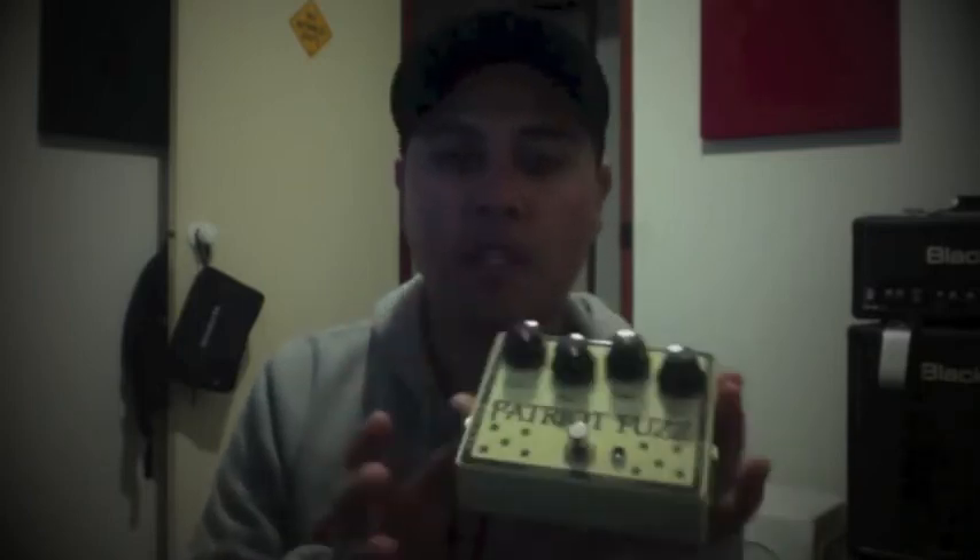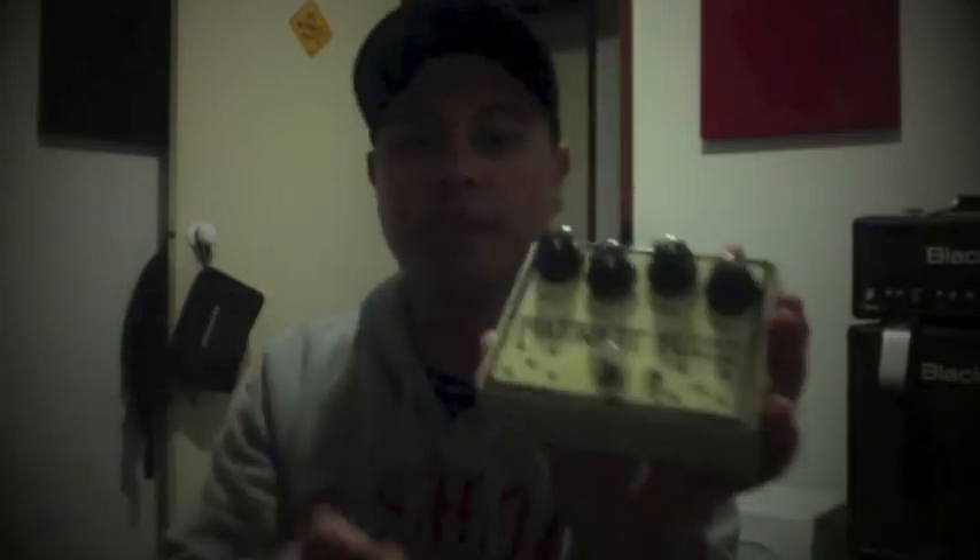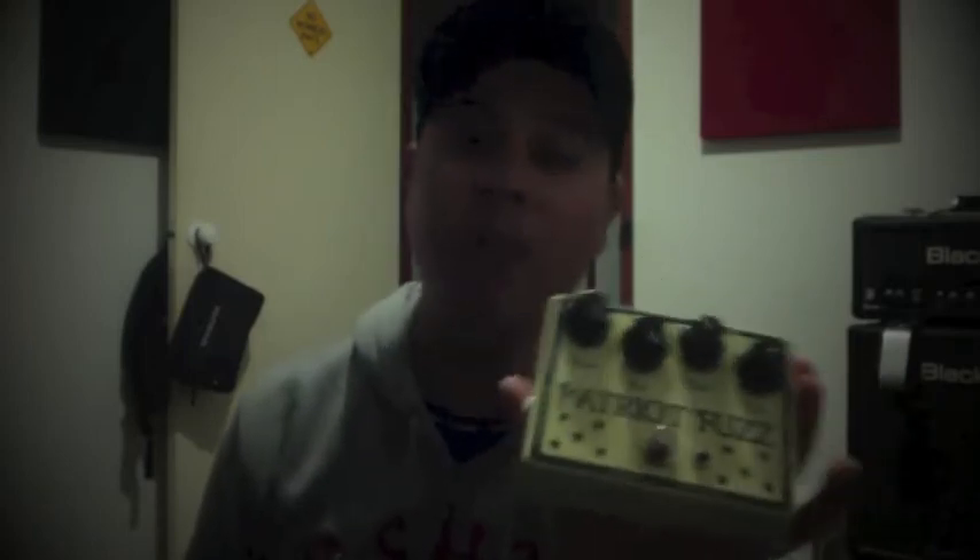This thing still has a few bugs in it, but it works pretty good. Finding the right transistors, that was the real challenge. This is typical of me — it's got my label on the back, runs off a 9-volt adapter, boss-style adapter, negative center, and works great. Tough as nails, made of an aluminum enclosure.